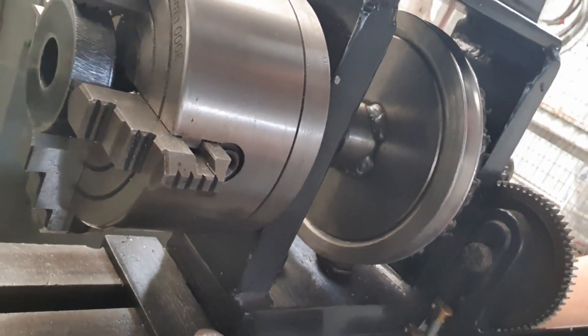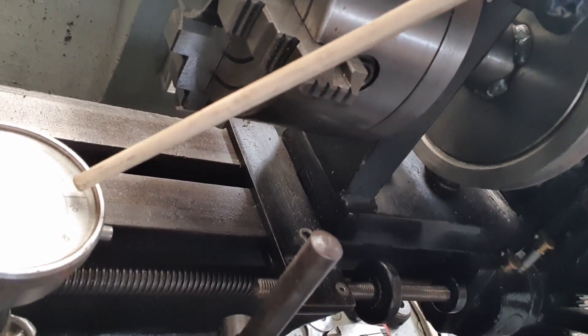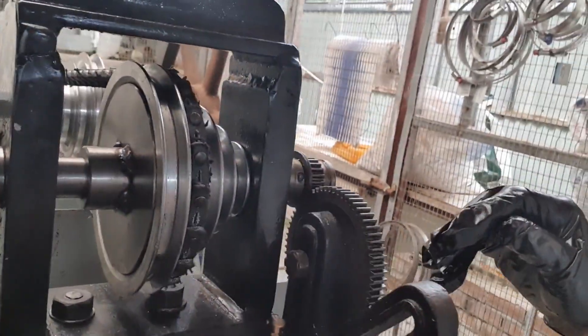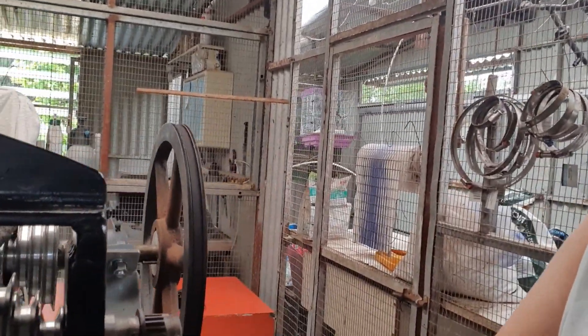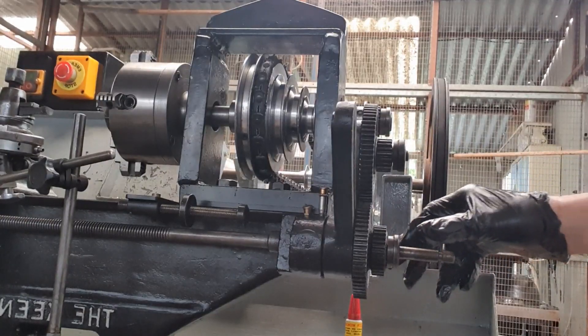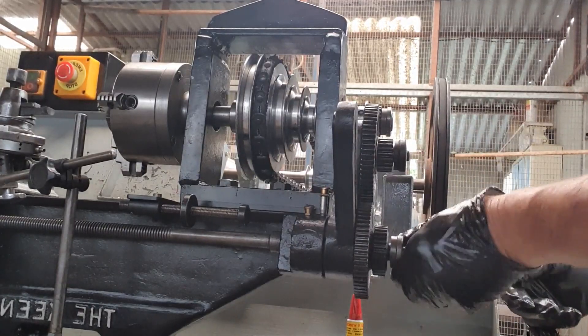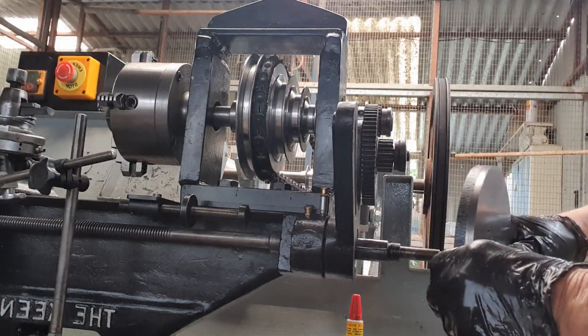I'll use my chopstick, might be a better idea. Zero, around the 40. There it is. That's how much movement you get in one revolution, which is not acceptable. That's one millimeter. So by changing a few things around, which I'll show you now — take this off here, put this on here and make the adjustments.